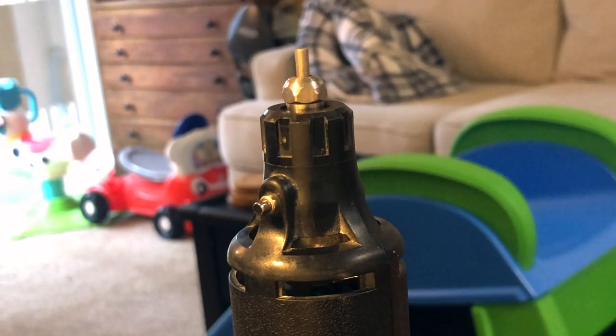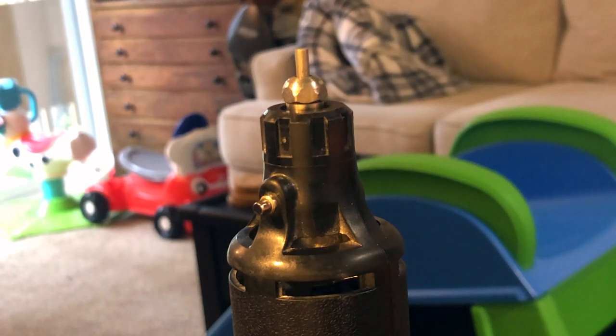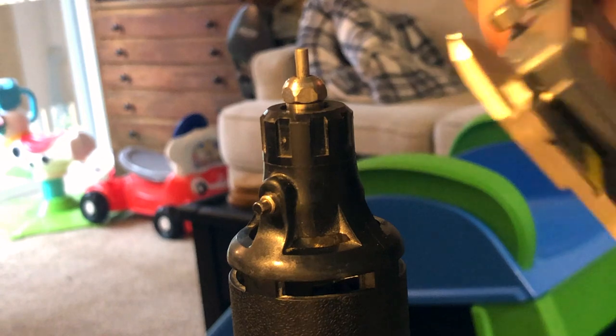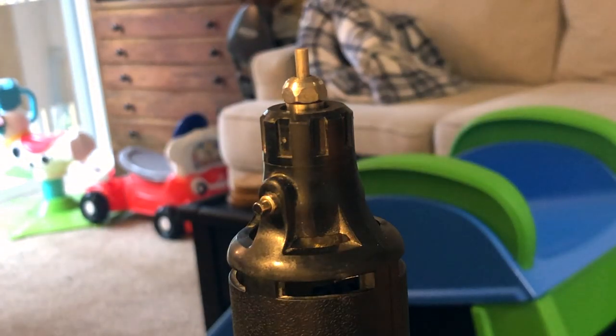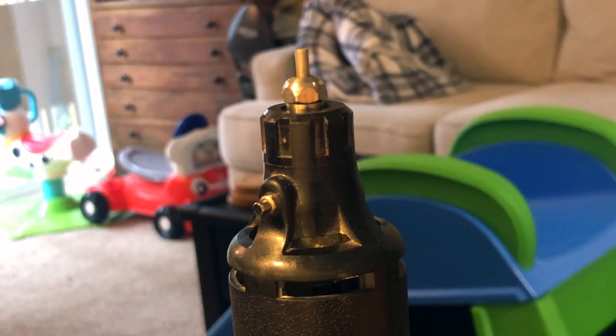Alright, so we got the pin in the vise. I did a little bit more refined work — I cut the pin down by half because we didn't need the whole material. So we have it in the Dremel, and we're going to go for just a basic spool for this demonstration. First off, we need to find how big this is to make sure it'll fit in the lock. That reads 3.21 millimeters for this, and our regular standard size pin is 2.93 — not too much different. So we've got to shave off a little bit of material, but not too terrible much.